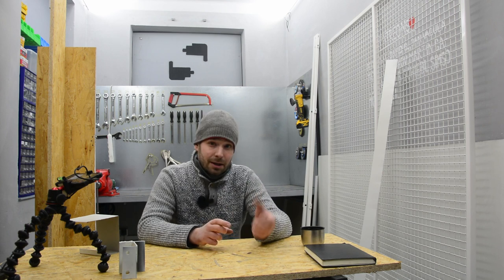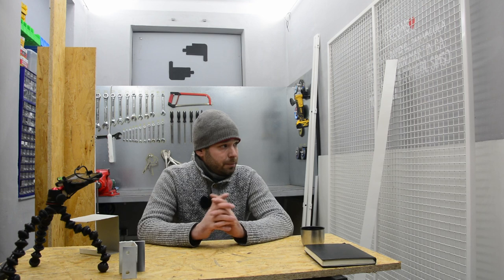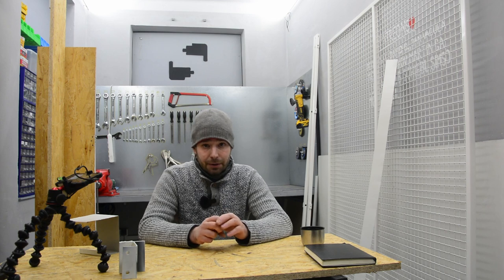And I learned that cutting the metal with the hand pliers is okay. I can do relatively precise cuts. It's not extremely straining on the hand, but yeah, I think I'm about to do it. I have to pay extra attention to the quality of the bend. So I have to cover the pliers and cover the bender and everything. Every mating surface I have to cover with some masking tape, just not to put any scratches on this. So that will be Thursday and Friday.